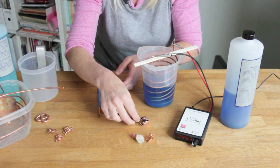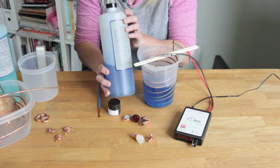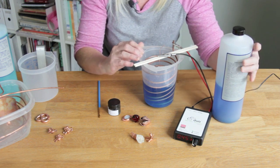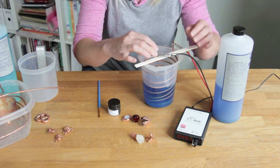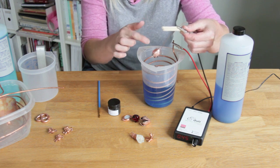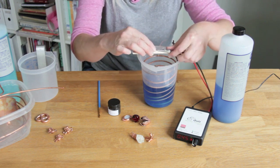I'm just using a copper plating solution, and in the beaker I've got copper — it could be a copper coil or scraps of copper — with the solution and my clips attached. You can see I have a piece in progress right here. I've wrapped a copper wire around the piece and you can see it's copper plating wherever I had the conductive paint.